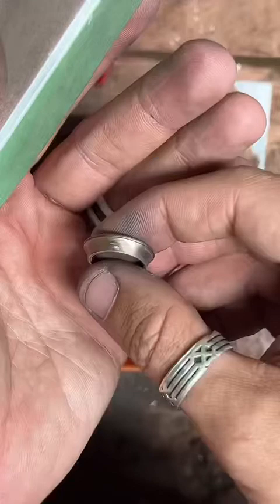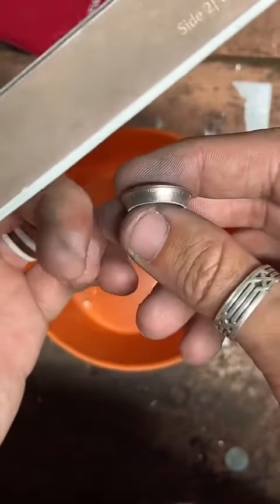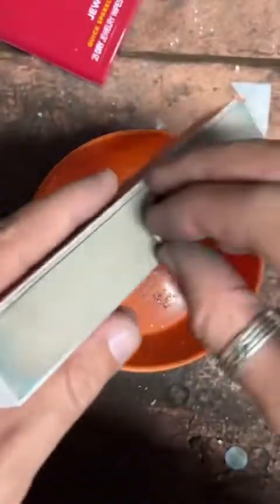How do you know when to anneal the metal? I try and do it in between every step, but you can start to feel the metal work hardening after a while. So I would say maybe after every 15 to 17 degree change on bending it. Maybe every 2 to 3 sizes anneal. It's always better to over anneal than under anneal, because if you don't anneal, it will make the metal stay brittle.